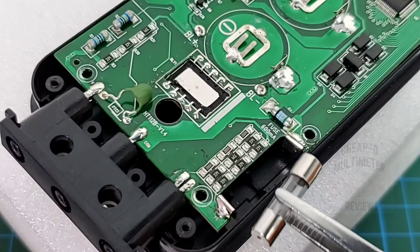Flipping it over — look what grandma brought home. Speaking of relays, there it is: one big honking relay. Right beside it, believe it or not, is our speaker — that is a piezo. You don't see ones that look like that every day. Take a look at that fuse holder assembly — I think they could have done a better job. Basically the fuse is just sitting in there by gravity; these are spring-loaded to a degree, but it's really not held in very strong. If you drop the meter, I don't know if it'll stay in place. I wish they did a better job with that fuse holder.